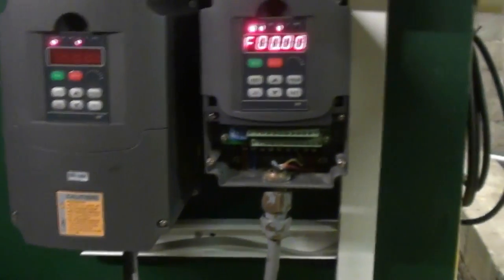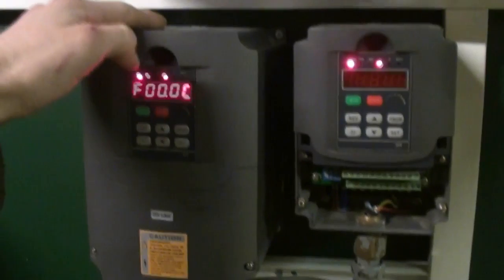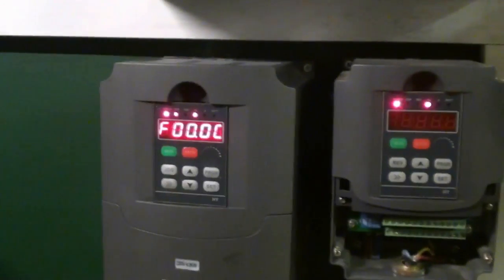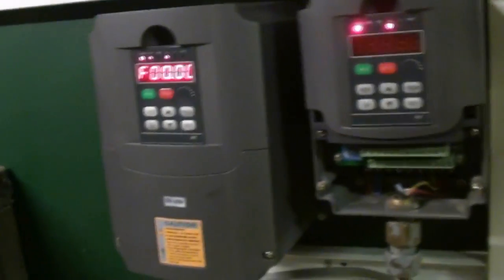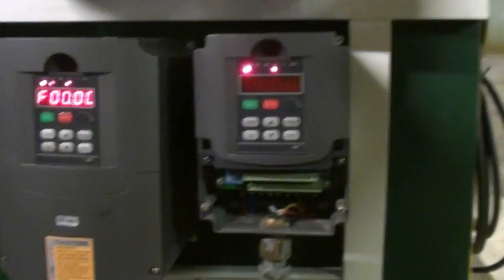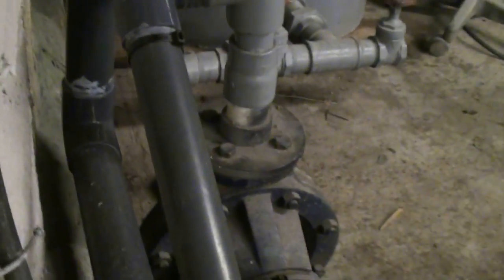They're both two-pole motors. I've put a three-second ramp up and ramp down on the water pump — it's only a small water pump. I've put a five-second ramp up on the extractor fan and an 11-second ramp down, just so that it doesn't use excessive current to slow it down, because it's a huge metal impeller and it takes a fair bit of stopping. By doing that you can press the green button and the red button and they will start and stop all by themselves. The water pump is now running, as you can hear. And then the same on the extractor fan.